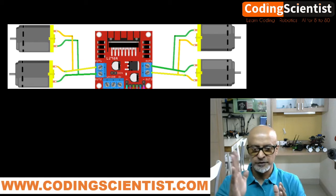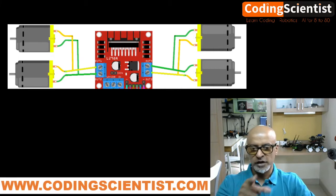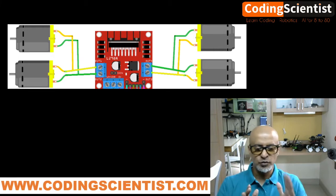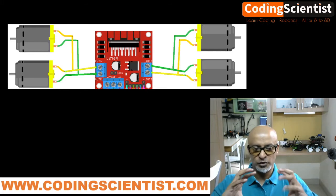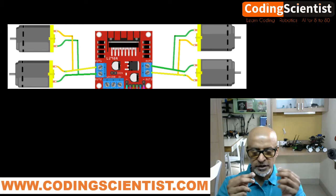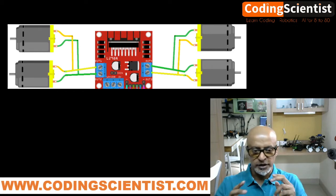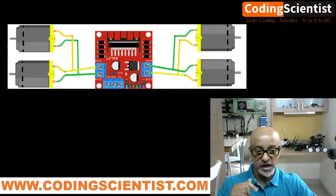That means the left side of the robot, two motors should be connected to one side of your motor driver board, and the right side two motors should again be connected parallelly to the right side of the motor driver board, and all the four motors should rotate towards forward and reverse. You have to just connect it to the battery and check the polarity. If there is any mistake even in one wheel or two wheels, your robot will run around here and there and it's not going to move in the right direction as intended.